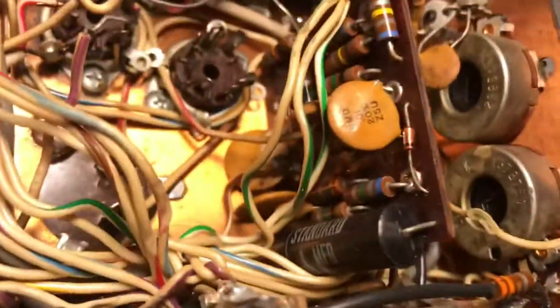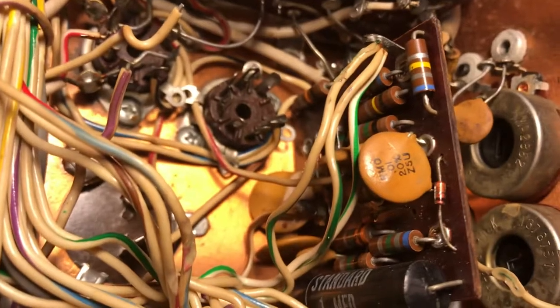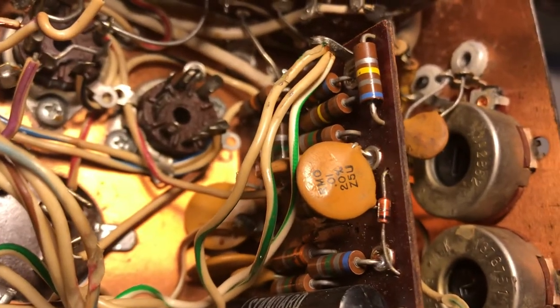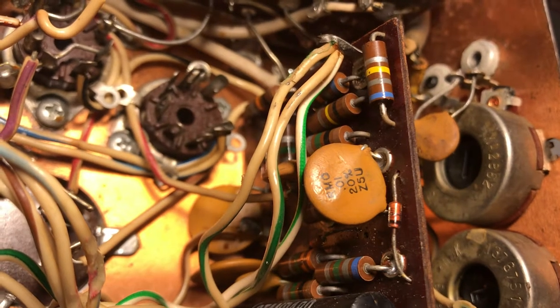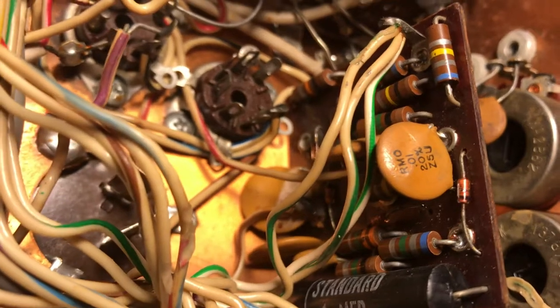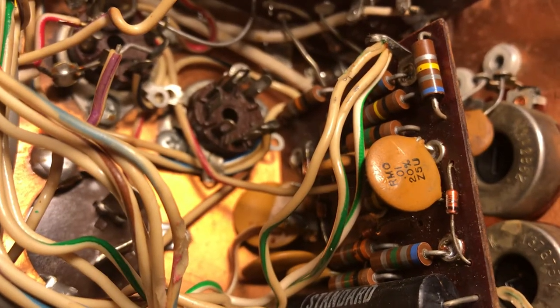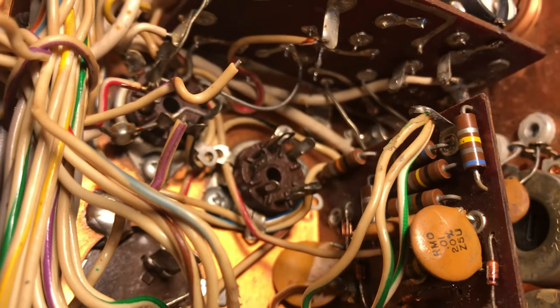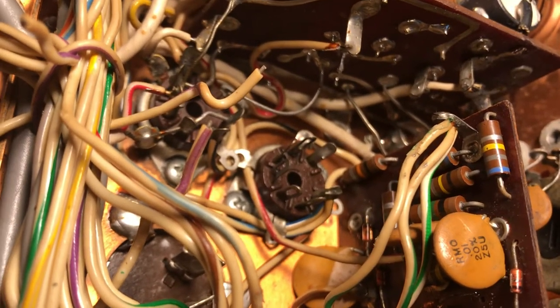The other thing I found was I couldn't really follow the book tune last night without unbalancing the SSB balance modulator. And so I really couldn't book tune. I couldn't get anything really to work well in SSB mode last night. I could get voice through it, but I couldn't unbalance the modulator here to do the carrier null. And so I find that there's one blown diode.